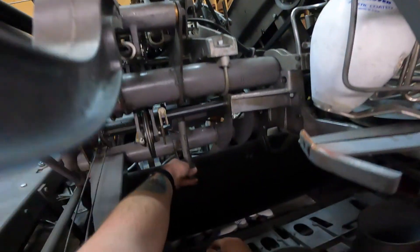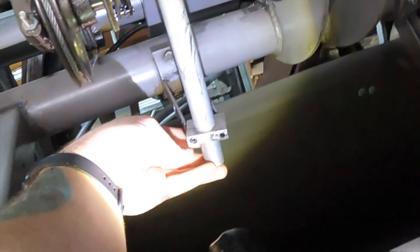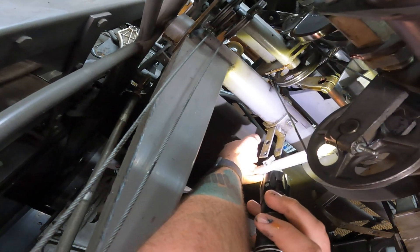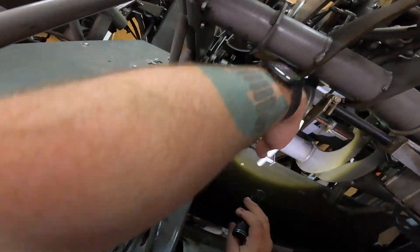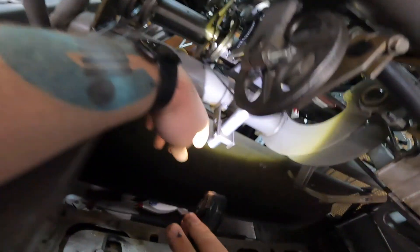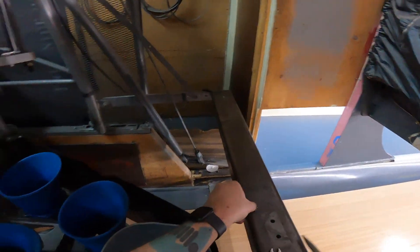The next thing you want to make sure is that right here on the rod, this allen head bolt — which is used for adjusting on your collar — is going to be lined up with this hole on the bracket that's on the deck lift shaft. With your roll pins on top of the bracket and your allen head on the stop collar facing the hole on the bracket on the deck lift shaft, go ahead and slide this X washer pin in to keep this set, then put your X washer pin on next.